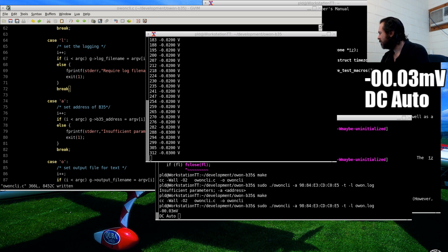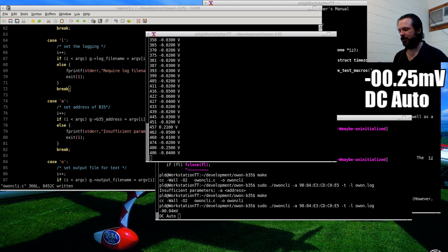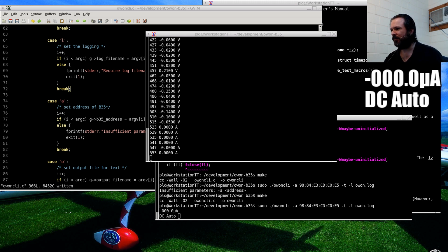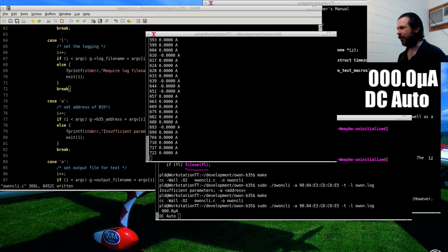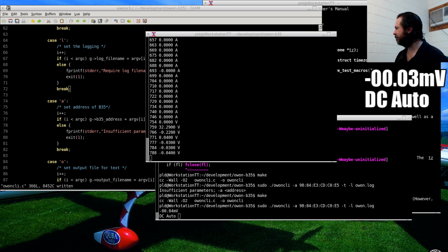How can you differentiate the small m for microvolts and millivolts? On this particular one, there's no microvolts. It's not that good a meter. On my ProTech, I did have that, but on this, it's got the 3 different amperage. Let's actually try that. Okay, so you can see I've got microamps there, and then milliamps, and then amps. The micro is prefixed with the mu character on the screen as opposed to an M, and same with the millivolts. So yeah, it's not a problem.